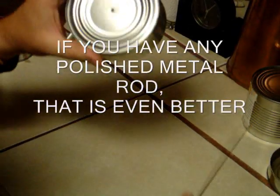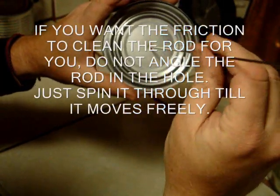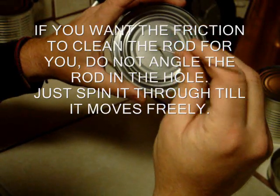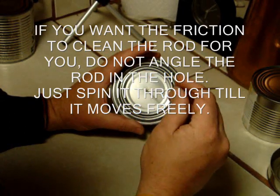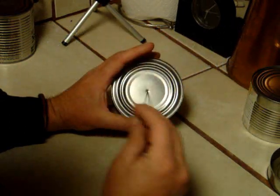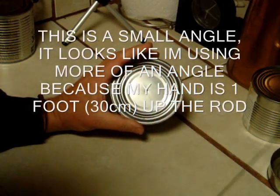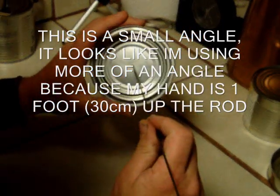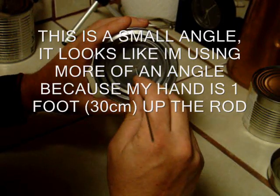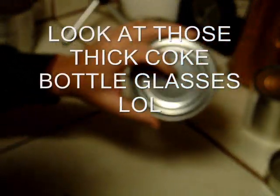Now I'm going to take this off. When you slide this through the hole — when you finally get it down to where it will actually slide through the hole — if you take it at just a little bit of an angle, just that much, and the same thing evenly all the way around, that will widen your hole just enough for this to slide freely. Trying to make your hole bigger with something else is going to make a lot of air escape, because we're trying to get this real close. When I wiggle this back and forth, it doesn't rattle, but it's still free to spin. Tolerances on that are very important.